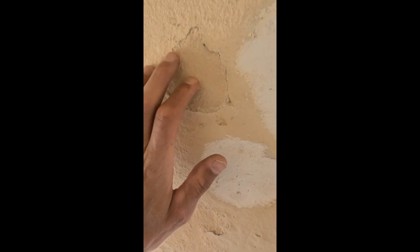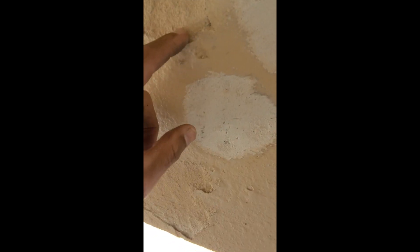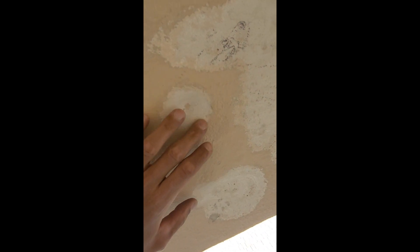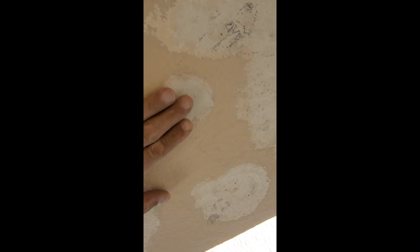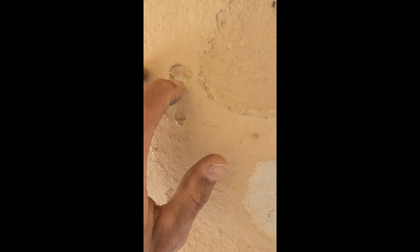We're opening up these pockets right now that have a section of stucco that's been taken out by the pressure washer. You can see in these other ones we've already opened them up. The goal is to make sure there's no edge left — you want to get that smooth so when the stucco goes on it blends nicely. You also want to make sure that anything in the middle of this section that's loose, you want to get all that gone. These edges right here are definitely loose, so I'll show you what that looks like when you take it back.